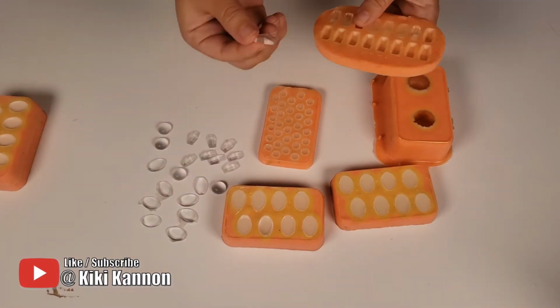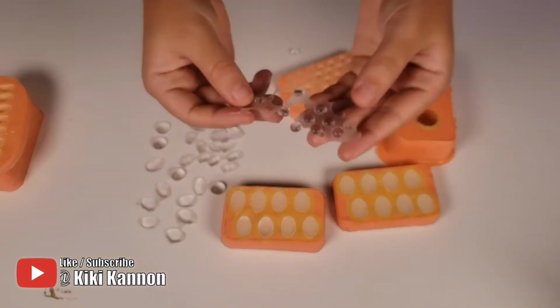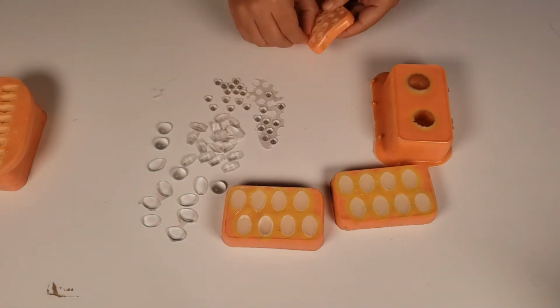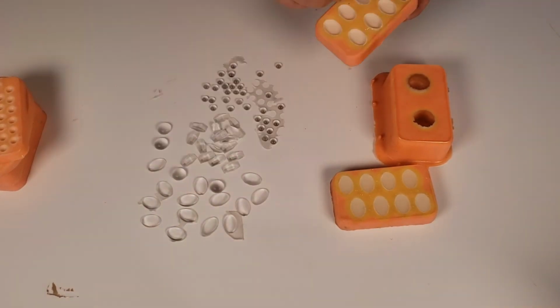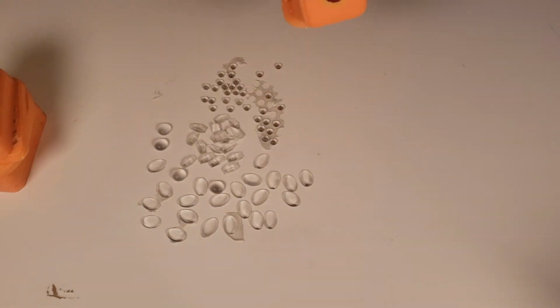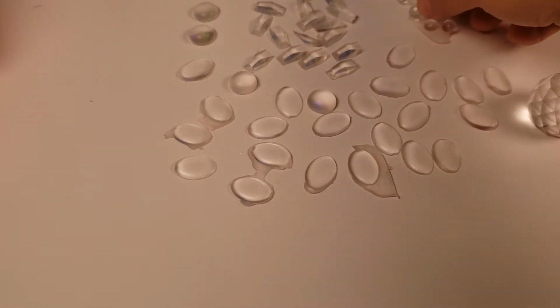If you have any results where the item is maybe kind of gummy, it's usually because it hasn't been the full 24 hours yet, or maybe your ratio was a little bit off. Sometimes if you mix really tiny batches, it can get a little bit trickier, so the closer you can get to the 130 or more is generally better.